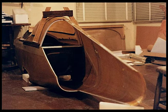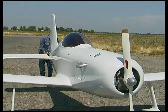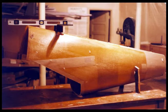Yes, sir. It's all straight lines, which I think is what you're asking. You saw the first part where we decided to make the fuselage sides straight, basically straight from the cowl, the firewall, back to behind the cockpit, or to the trailing edge of the wing. It makes a little compound curve there, which we have to carve freehand, and then from that point on, the tail cone is all straight lines. Sir?